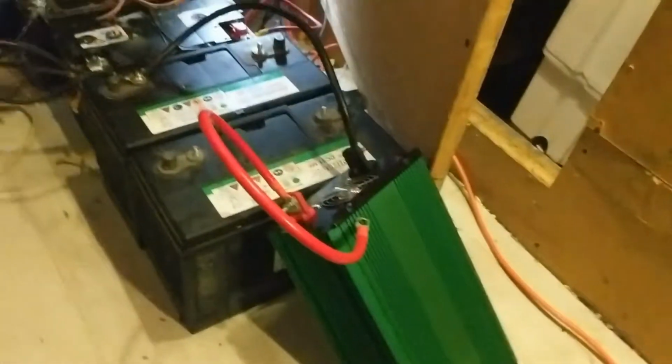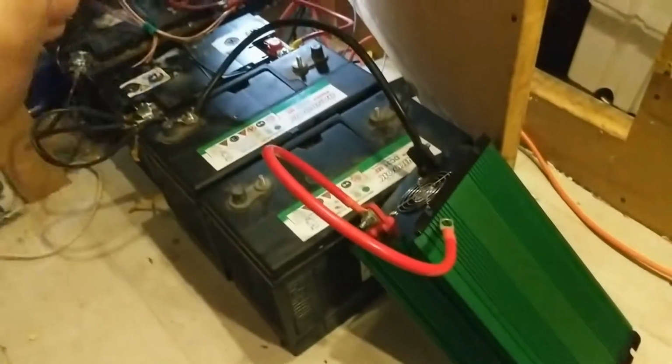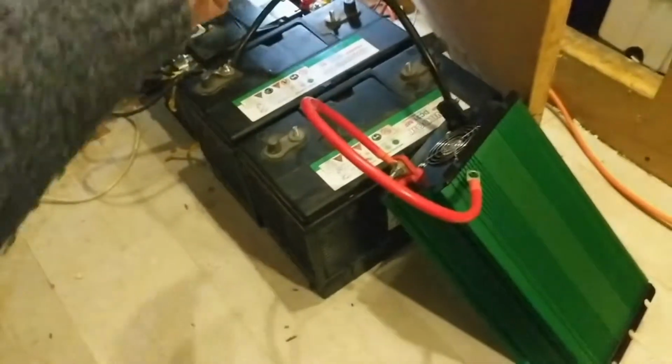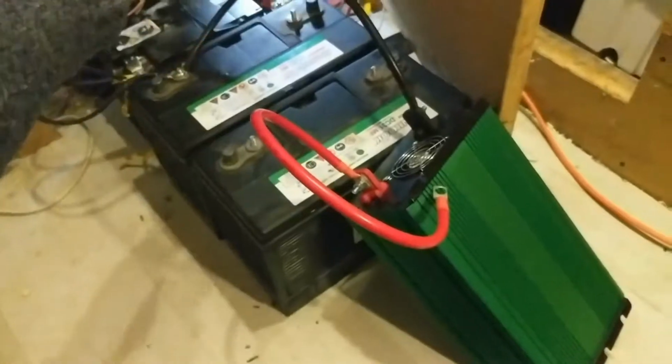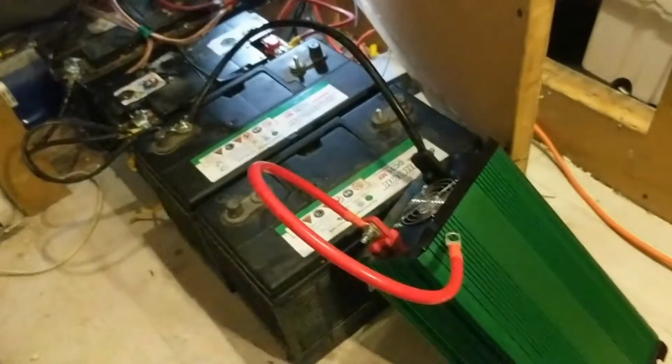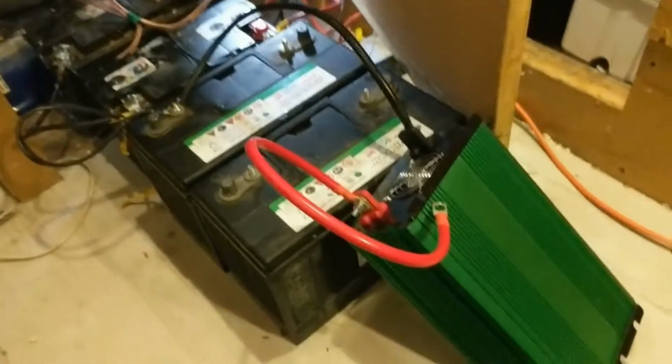And you would think of it, it's not a soft start, really. It's a pre-charge. And like I said, it has a bit of resistance that bypasses the contacts to give it a slow ramp up to 12 volts, and then you can switch in. Pre-charge relay, that's what you need.